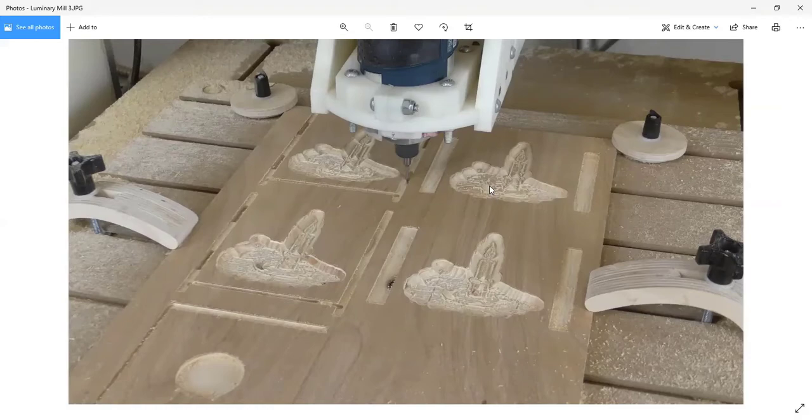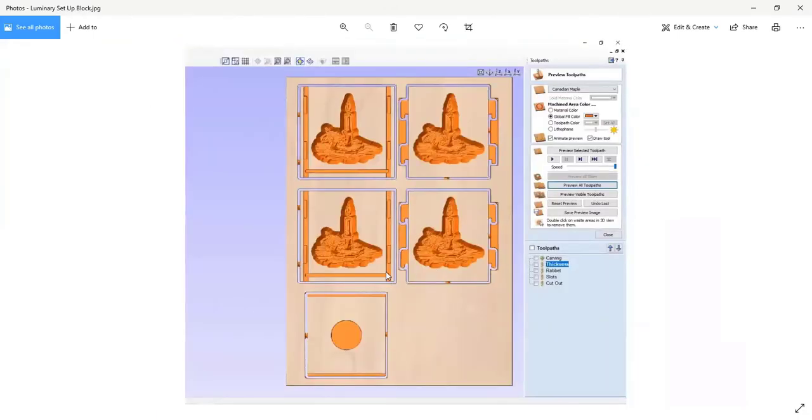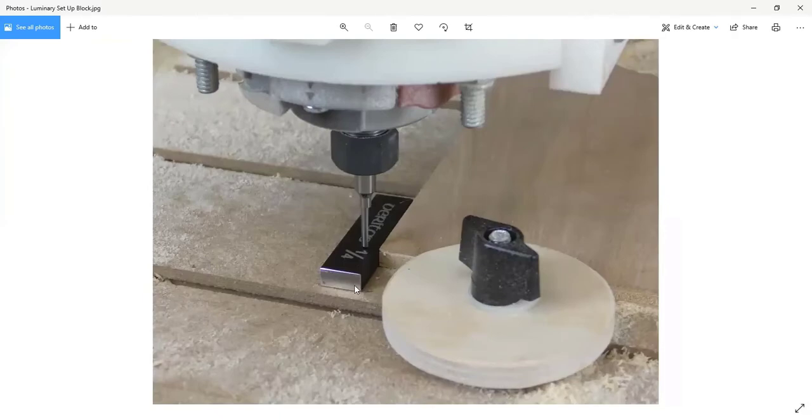When you do the flipping operation or the milling on both sides, generally your part's going to be already cut out. It's already going to be the size it needs to be, or sometimes you can cut halfway through on each side. But you need to be able to locate those parts much more carefully on the machine, because you absolutely have to know everything lines up. Here, I don't have to worry about it because ultimately it's all getting cut off this one setup. So there's very little tolerance between one setup and another. Any machinist will tell you, if I didn't cut it on this setup, I can't trust it. That's kind of how we work here. A lot of this was based on surfacing off of a known setup block rather than relying on the thickness of the material. So any questions on any of that?